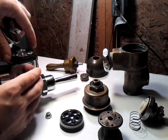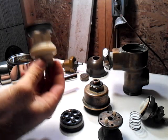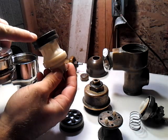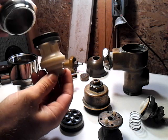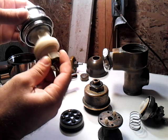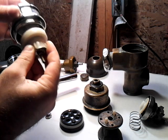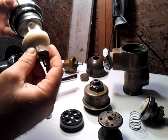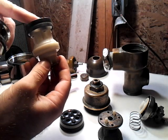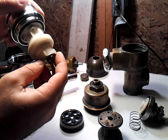I would bet these are probably the best piston flushometers that have ever been made as far as piston valves go. So you've got your cap, then you've got the piston — this whole thing here is the piston assembly. You've got a rubber cup here, which is kind of a double cup, that goes inside of the bore, the cylinder. This piston actually seals inside the cylinder. On top of this piston you have an upper chamber, and below it you'll have what's called a lower chamber.